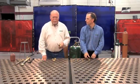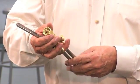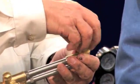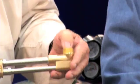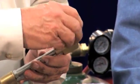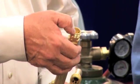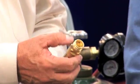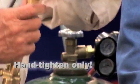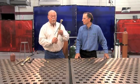Here's a typical cutting attachment. Do the same inspection on the cone end as just advised. In addition, we also want to make sure that we check the seating end for the tip — no dents or scratches in here because this will eventually be a metal-to-metal seal. Before attaching the cutting attachment to the torch, you want to inspect the seating area of the torch handle and also the thread assembly. Then you want to attach them hand-tighten only.